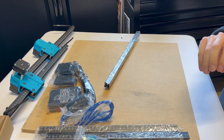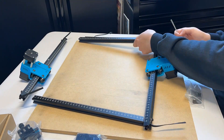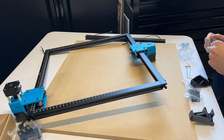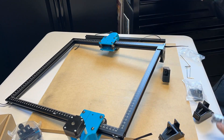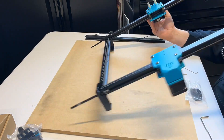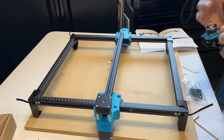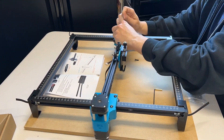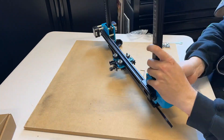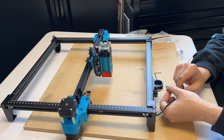The assembly on this is actually quite long. They say it's 60% pre-assembled, but I really do not think so. First I'm just laying out all the extrusions in the correct order and sending one screw through on each corner — do not over-tighten them, just barely snug — because we're going to put the feet on each corner with an access hole to tighten that screw. The X gantry has a lot going on — a lot of parts to put in and a belt that's pretty difficult to route. I'll put a link in the description so you can review Two Trees' assembly video on their site. It's about a 15-minute video.